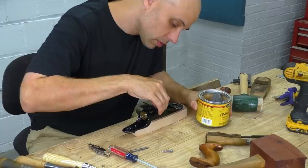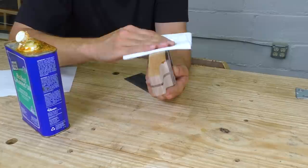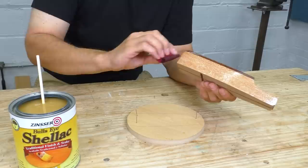After that, everything is finally done and I can test assemble. I drilled my holes carefully and I'm waxing all my screws so nothing splits on the way in. Once I get the whole plane assembled, I give the body a coat of boiled linseed oil to pop the grain and make it a better match for James's outstanding handles. I'm going to follow that up with a coat of shellac just for protection and a little bit of shine.